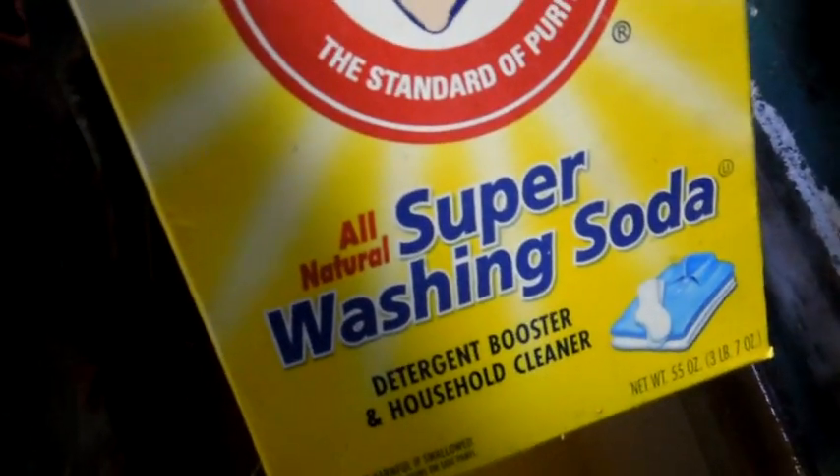It's been about 18 hours and I've taken the part out. This was fresh water when I started with just a little bit of washing soda added to it. I've brushed these anodes off once — I would take the part out of the water, brush the loose layer off the part I'm cleaning, rinse it off with fresh water, and put it back in the solution. You can see how all of the rust leaves the part and gets redeposited onto these sacrificial anodes.